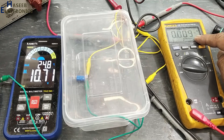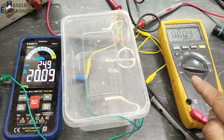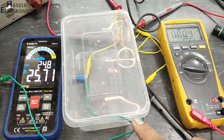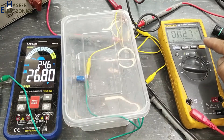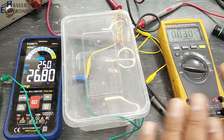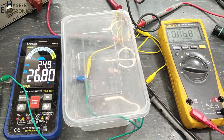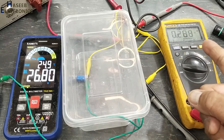For the 16 volt capacitor at 18 volts, current is just only 9 milliampere — that is normal. We then provided 26.8 volt to the 16 volt capacitor and current started to flow. Now the voltage is stable but the current is increasing — this is the over-voltage condition.